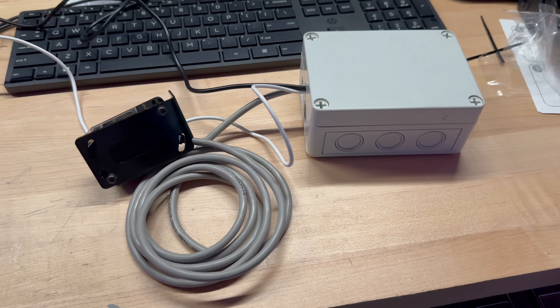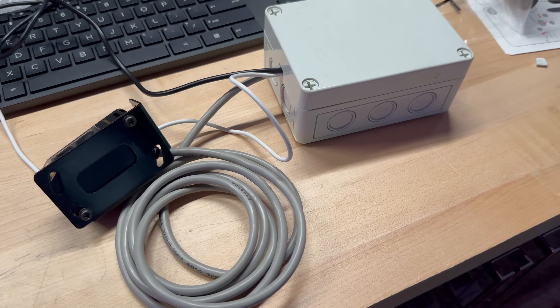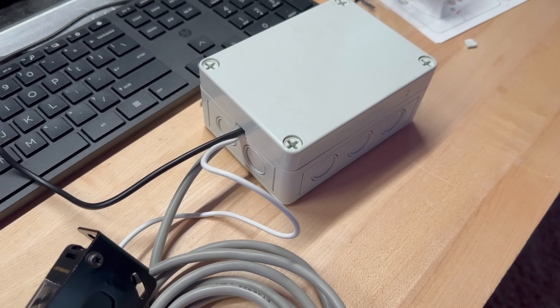I placed the power connections and the Heltec module inside a plastic waterproof case. I assumed plastic was the way to go since I needed the WiFi to work, and I'm happy to report that it connects reliably each and every time from about 200 feet away. The sensor is mounted to a sturdy pole and the Heltec enclosure sits with a fairly clean line of sight to the wireless access point. Now, what about the code on the ESP32 to monitor the input, do the WiFi connection, and transmit to the web service? I've put the code on GitHub for anybody who wants to replicate my results, so I'll just give you a quick tour of the highlights.